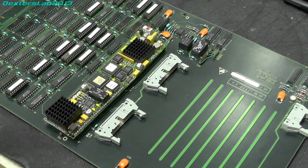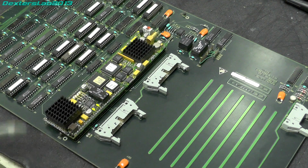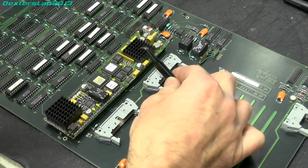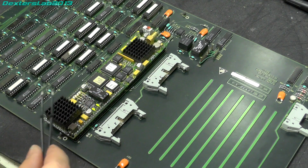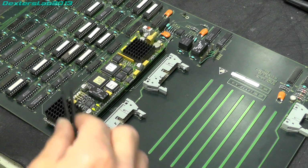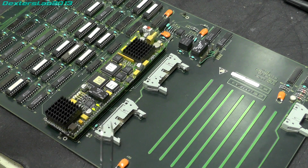So this provides the mechanism to transfer the video to and from the Ramcorder and the paint box. This particular one here is the SDI receiver that takes SDI input, deserializes it and then converts it into the internal video format that's used in the Ramcorder. And this one is the opposite of that. It takes the video, converts it into Rec 601 or BT 601 format video, and then sends it to the serializer to actually go out as serial digital video.